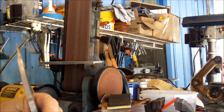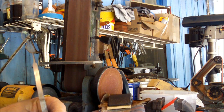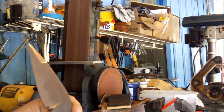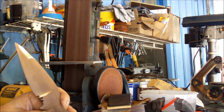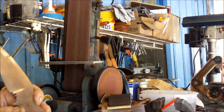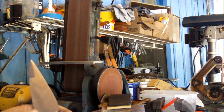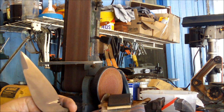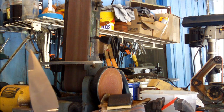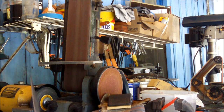I already had a 5/16 of an inch thick blade, so there was quite a thickness there, and I ended up losing some material here. This ended up being a low spot, which is, as you can see, if I get down to where I'm sanding along the edge of the blade, then it's flat, and this is just a low spot that'll be hidden. Over here it's pretty flat. I just have some pits along here and here, which were from maybe casting or when I forged it, the metal. So this will be real flat when the handle's covering it up.